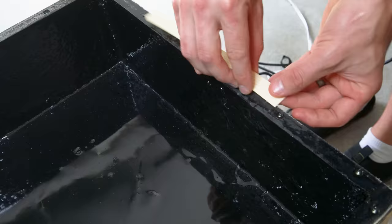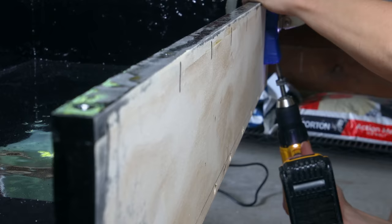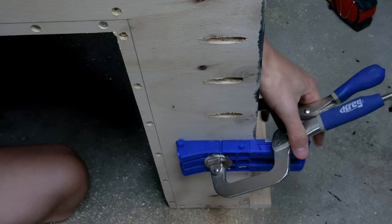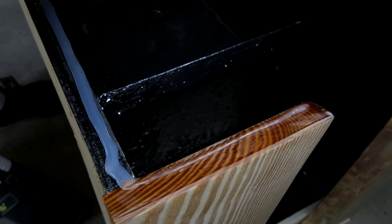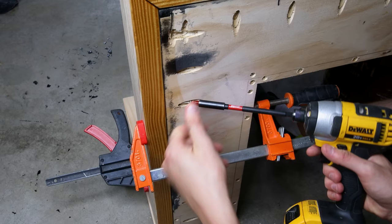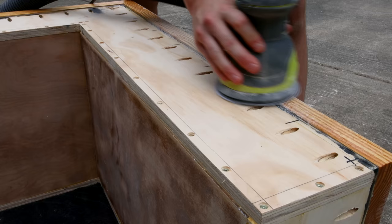Prior to attaching the boards to the plywood, I stuck a piece of veneer to the edge of the top. This spot will be visible on the finished product, and having wood grain here will look much cleaner. I don't want any fasteners to be visible on these boards, so I created pocket holes in all of the appropriate areas. Even though the boards are sealed, I applied a bead of silicone between the seams. This will create a gasket to protect the wood on the exterior from moisture. I clamped the boards together, locked them in with screws, and fastened them to the underside of the bottom. Once the silicone cured, I sanded the edges to ensure everything was uniform.